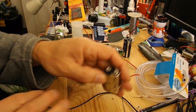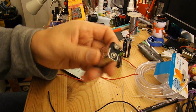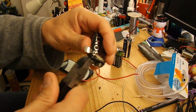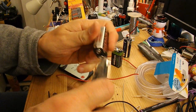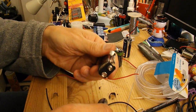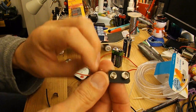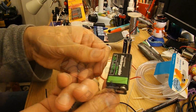First thing I'm going to do is take this apart so I can get the end plate off it. I've done a little help file on how to do this but I'll do it live. I've got a pair of pliers or nippers — we can just peel away the edge of the metal casing. Do be careful, this is sharp. That slides out. There are a couple of different types of batteries but I won't go through them just now. There we have the connector, so I can solder my red and black wires on there and then use that to connect onto the good battery.